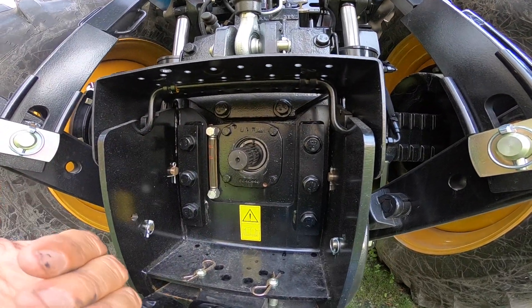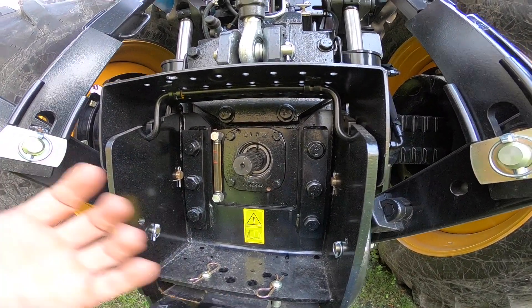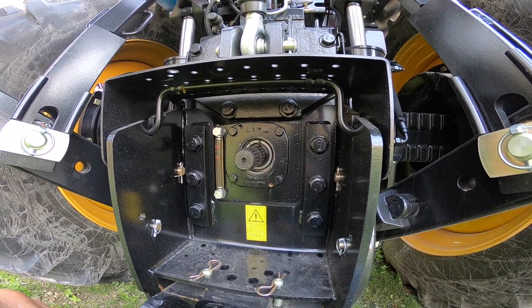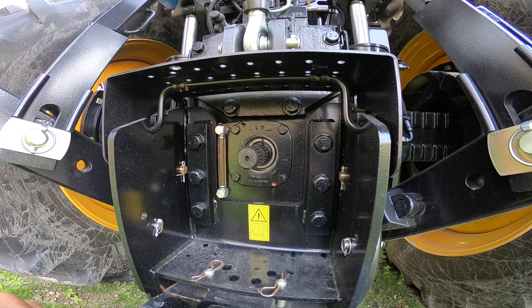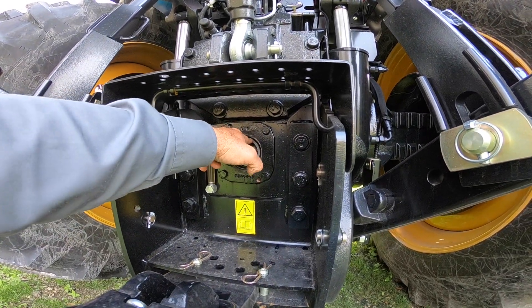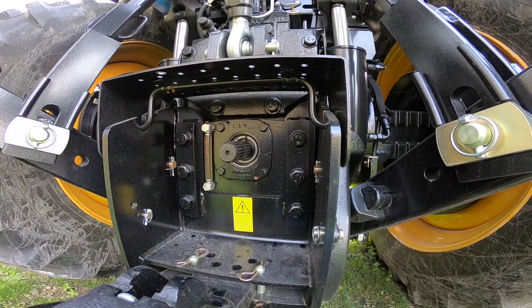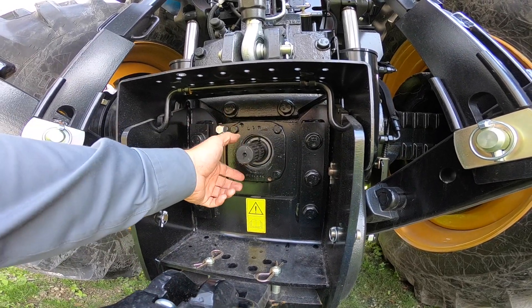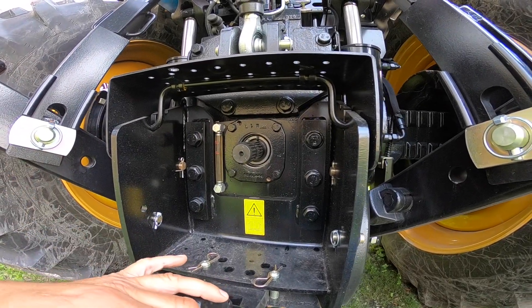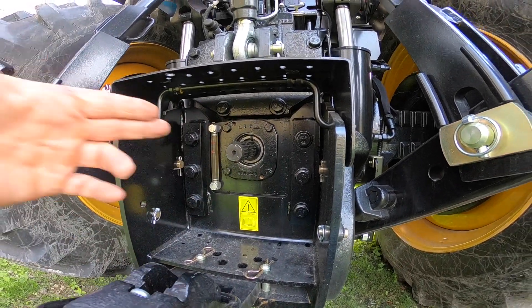You're not going to have a bunch of oil come out, so you don't have to worry about that. You're going to have your 540 shaft which will come with the tractor if it has the dual speed option — it'll be in the cab of the tractor, or should be. So we can simply take our pliers, remove the snap ring, and pull the shaft out. Sometimes you may have to take a dead blow hammer and tap it a little bit, but it should just pull right out.